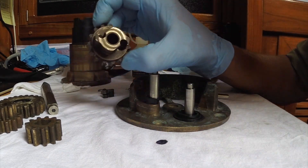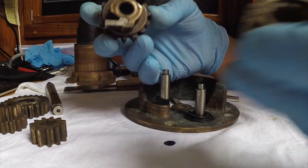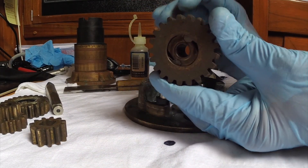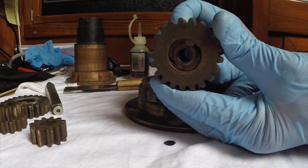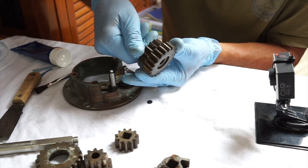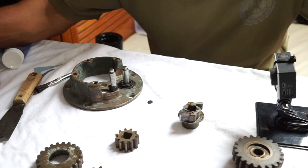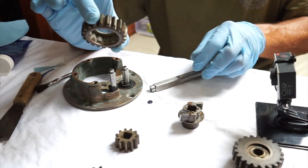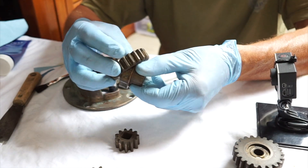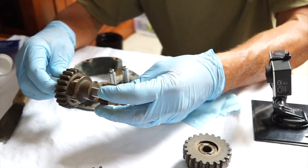We've got another set of pawls that go in this gear mechanism here — two pawls that go inside this thing. What you get is a nice clean ratchet. That's what a winch is supposed to sound like, and when it backs up it locks. When I pulled off the top of the drum there was this gear which has pawl ratchets inside. This thing rides on a square shaft — this is exactly how it lays.